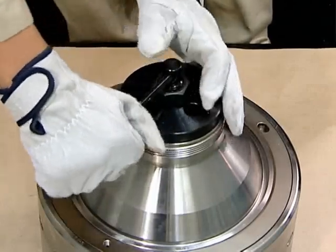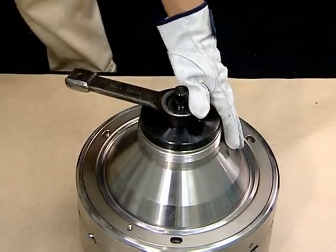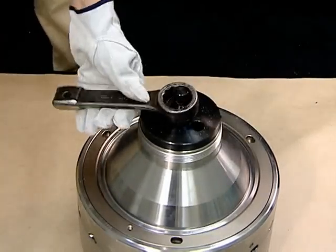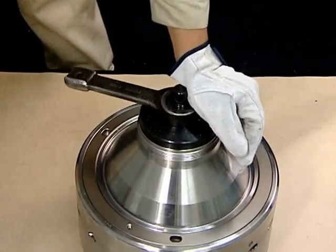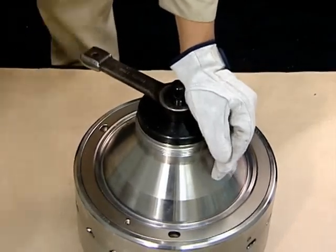Screw the push bolts of the disc clamp plate into the guide tubes and firmly tighten the hexagonal nuts with a hammer, like this. This procedure is important. Its purpose is to dampen the springing effect in the disc mounted on the bowl to protect the thread of the bowl nuts and make it easier to release the bowl nut.